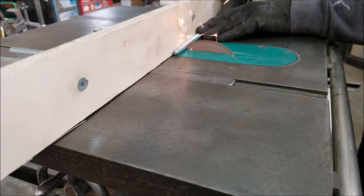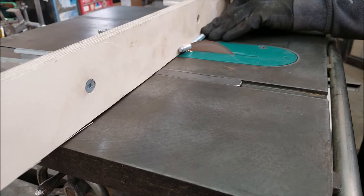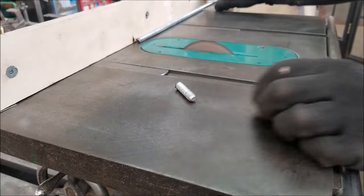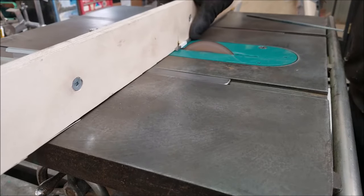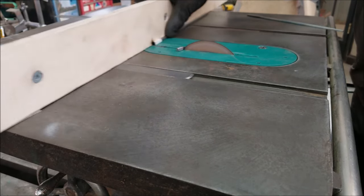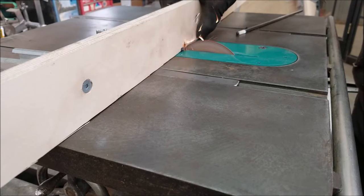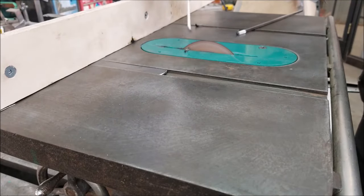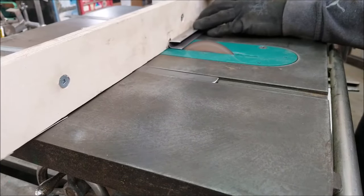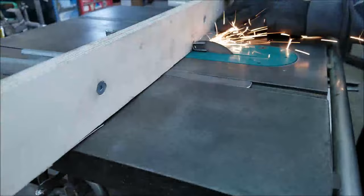As I'm testing everything out here I'm going a little bit slow — I'll have to admit I was a little bit nervous; I wasn't sure exactly what was gonna happen. But so far I've never had any really scary moments. The key is having the sled making contact on both sides so there's nothing hanging out and you can't bind on the blade. I've actually noticed the blades are lasting quite a long time — I think it's just because it's cutting straighter. That's a little itty bitty keystock there, and this is actually some of the channel that I'll be using on the light.